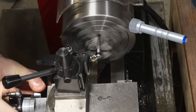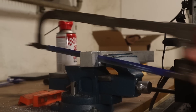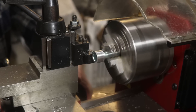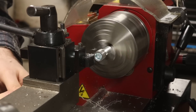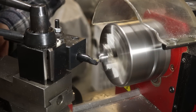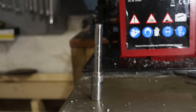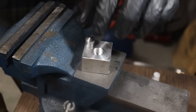Now we've reached the unavoidable: the 8mm hex at the end of the pin. I have no means of cutting one of those here in my garage — I would need a rotary broach. I could make one but I don't really like the idea of spending a few weeks on a side project like that. I need to finish my motorcycle. There is always the option to buy, but a good one that will fit my lathe is likely to be expensive. Nor do I want to wait a long time for shipping. One could just slit the end with the angle grinder and use a flathead screwdriver, but I don't really like that idea. It's too pretty of a part for that. But I have an idea.